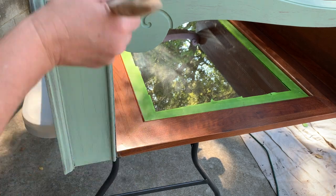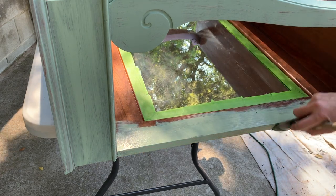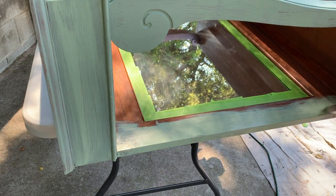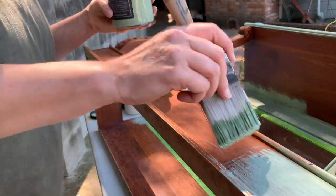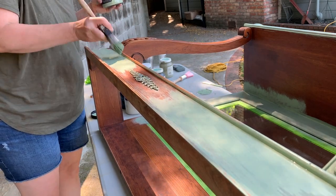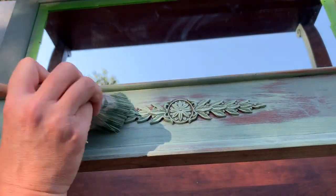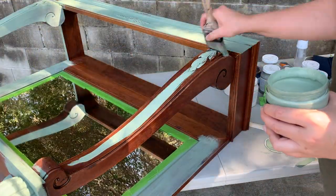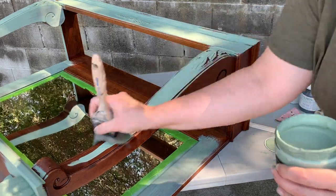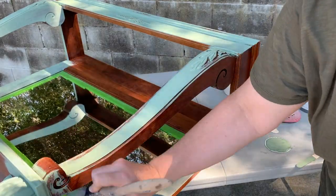As I worked on my first coat, I saw right away what the fuss was all about. This paint was having great first coat coverage over this medium dark finish, and it just felt great coming off the brush. Melange recommends natural bristle brushes for their paint, but also says that zebra brushes work really well. And so you can see I am using my trusty zebra chiseled wedge, and it's doing a great job managing all the twists and turns and corners and grooves and details of this very cool piece.